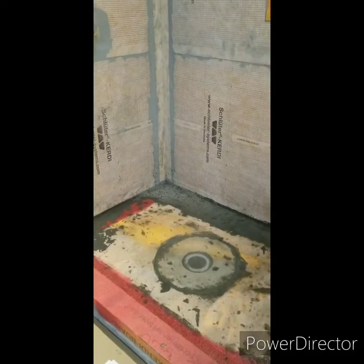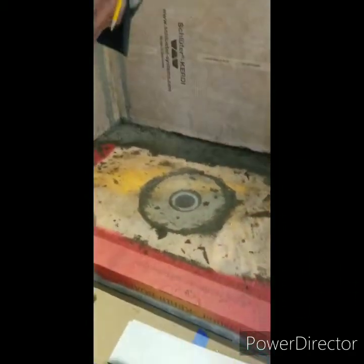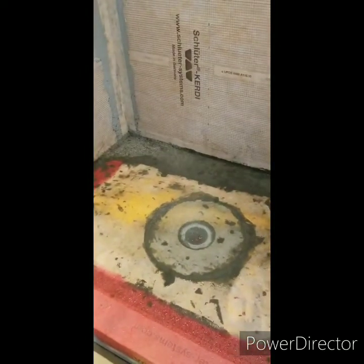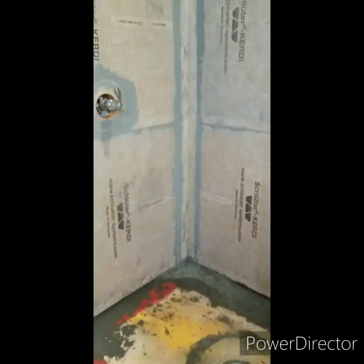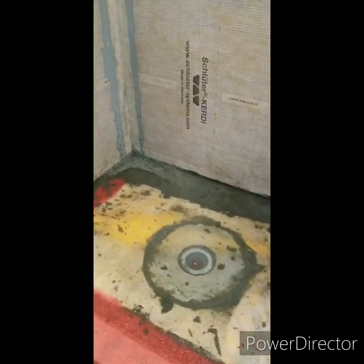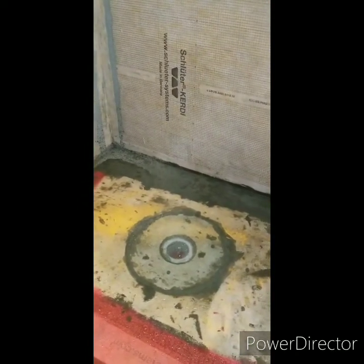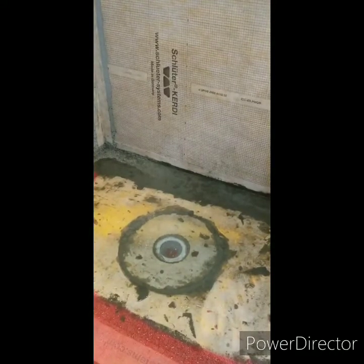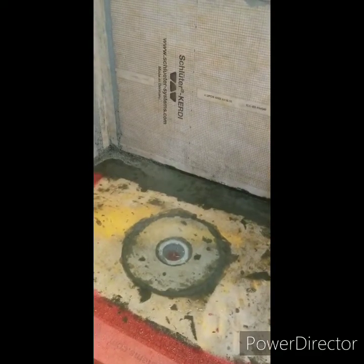Fill it up at least until the bottom is fully covered. And as long as we're not above the curb, it can be fine. Then I'll make a mark somewhere on the wall wherever the water line level is. Let it sit overnight and check it again. And if the level is at the mark that I make, we're good. If it has dropped, we got some other issues, so we'll see.